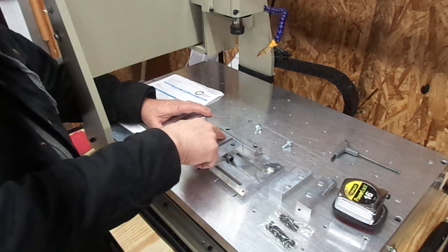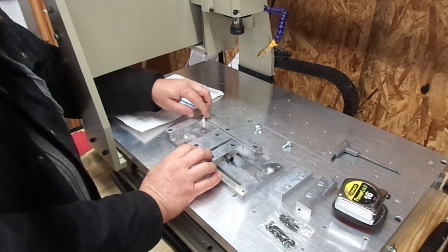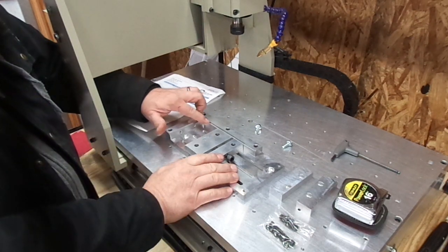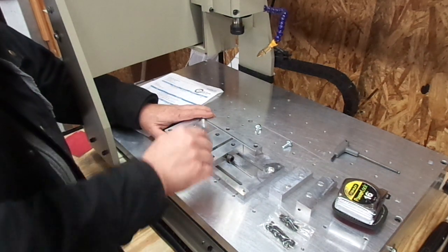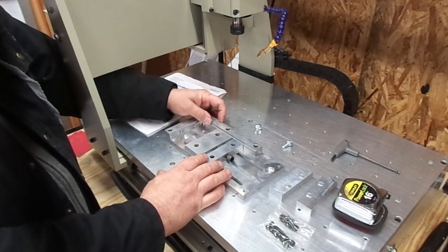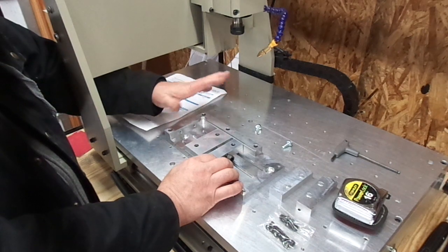It's three and a half inches on the open jaw, and four and a half inches total width. What's unique about it is it has the same layout as regular low profile vises — it has this other section with a built-in parallel, so the parallel cut is across here and also all the way down this rail, so you can support your part in three places. That's pretty cool.